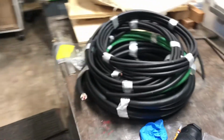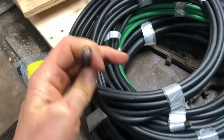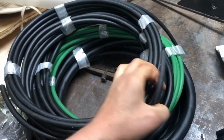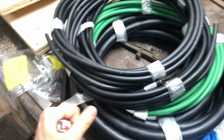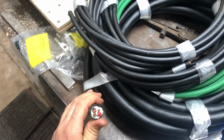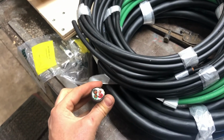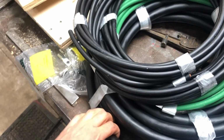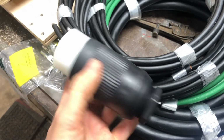And I also have a selection of type SC. This is just 6 gauge because I have a small service inlet in this building, but this is type SC cable, so I'll use this in single conductor to feed the panel. And then I also have a SEOOW. I like the SE instead of the SOOW because it doesn't smell bad. So this is a number 6 by 4 conductors, and I'm going to make a 1450 extension using these ends here.